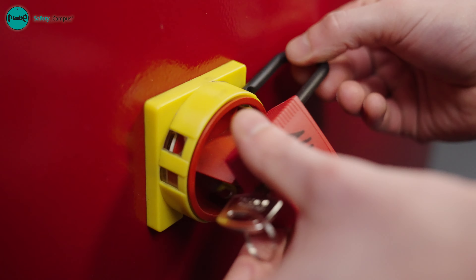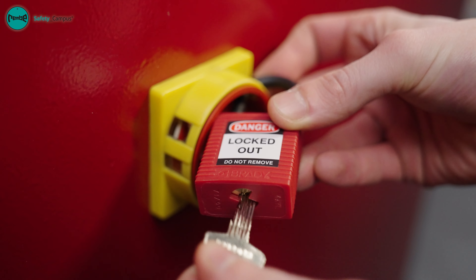Safety shoes must always be worn when working on plant components. To work on a plant safely, the process must be pressure-free. In addition, it is important to secure the main switch from being switched back on. Before starting work, the corresponding area should be secured.